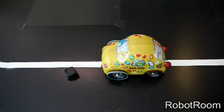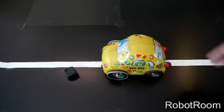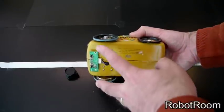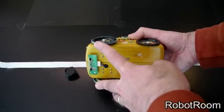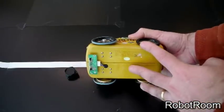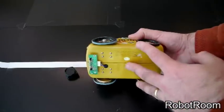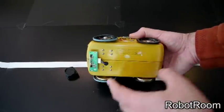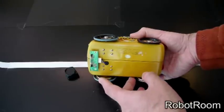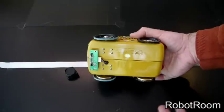This Yummy robot made out of an M&M's candy tin has four wheels. The danger of a four-wheel robot in this case is that it has two powered wheels with rubber bands for traction, and two non-powered wheels. If the weight of the robot rests more on the non-powered wheels, or it hits a bump, or takes a turn where a powered wheel doesn't have enough weight on it, the wheel will just spin in place and the robot won't go anywhere.